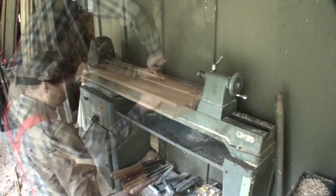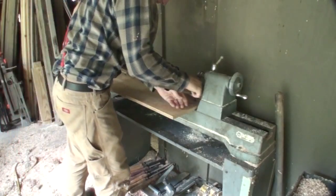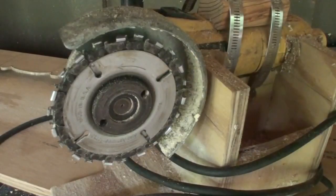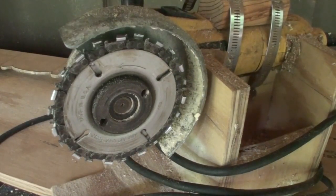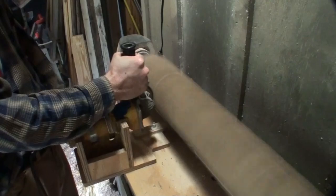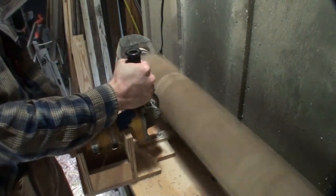I'm going to use the duplicator just to turn the top parts of the legs. This is mainly for my farm tables which have 29-inch legs and one-inch tops, so with the 33 and a half inch legs on this kitchen island I'm only going to use it to turn the top parts and then turn the lower parts of the legs by hand.